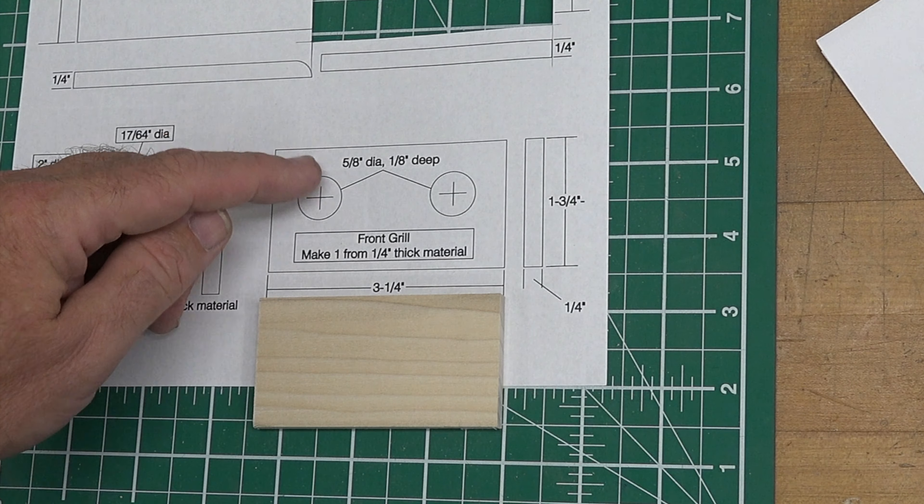The rear drum shows three inches wide and two side discs that are a quarter-inch thick — that totals three and a half inches of thickness — but on the actual rear container the interior dimension is only three inches. So I'm going to have to make some adjustments. I need to laminate some pieces for this bandsaw box rear container. I'm going to laminate together some three-quarter-inch thick pine to give us one large block in order to cut this, then head over to the bandsaw once it's dry.